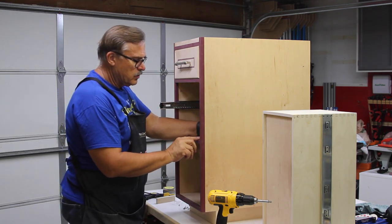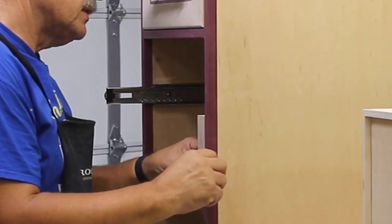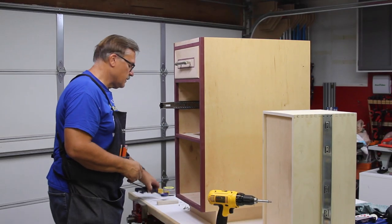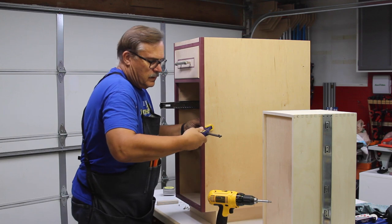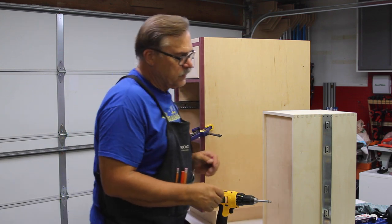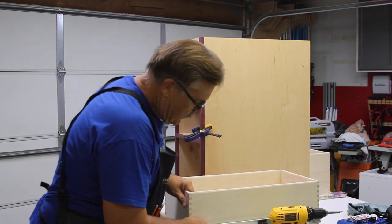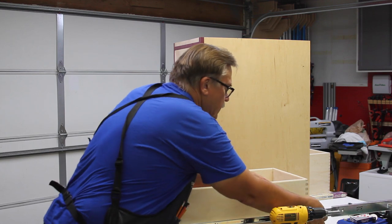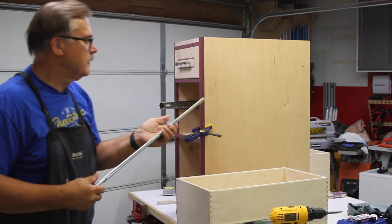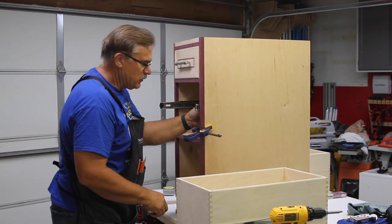I will put this where my quarter-inch piece is down at the bottom. I will place the jig so that it's flush with the front face of the cabinet, then clamp that on in. Now I'm going to remove this part of my drawer slide and take the drawer slide again, lining up the front of the drawer slide with the front of my plywood jig.